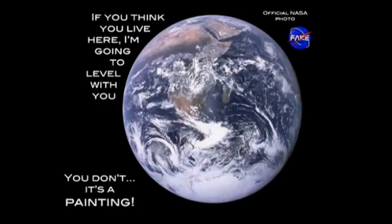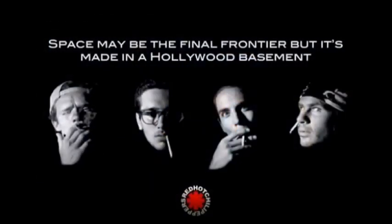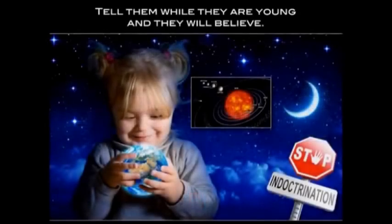What you got, Jerry? Yeah, I think I didn't have to do a lot of climate control with what I had. We had a bake-out process that we would actually use to help bring the chamber into vacuum because, say I would clean a thing or wipe a chamber down with IPA, that would still leave some moisture in there, and we would bake it out to help speed up the process. Because that would severely dampen the pump down time. Pump down time was huge in the semiconductor industry, but I don't want to touch into an area that I really didn't deal with.